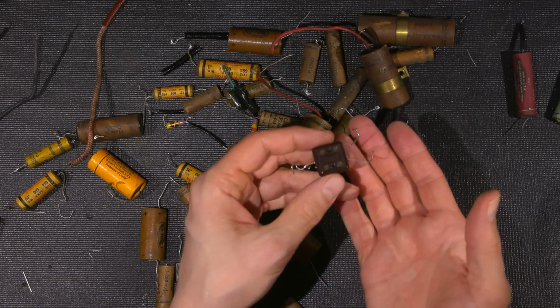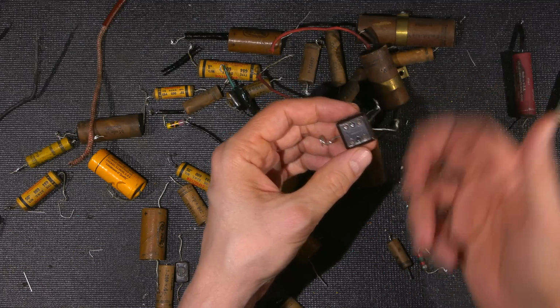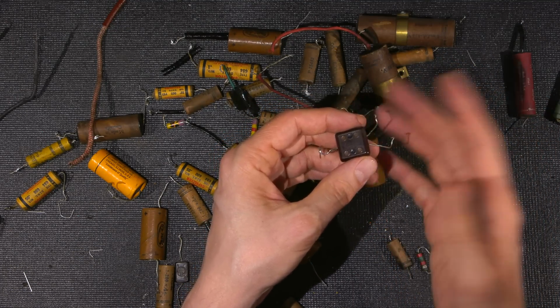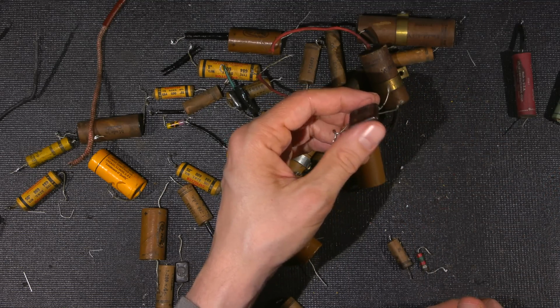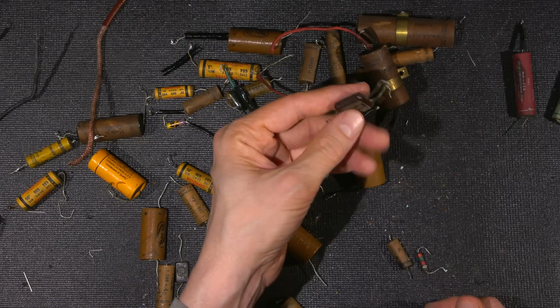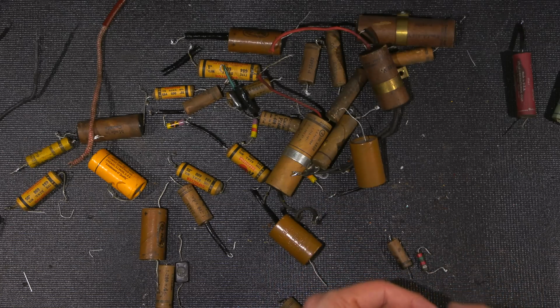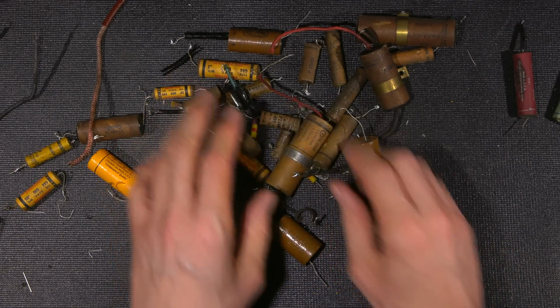Now, you'll test it on your normal tester, and it'll look fine. But if you do an extensive test with the capacitor tester that I've created, you can really see the problem. I created that capacitor tester because I was working on transmitting gear, and some very high voltage mica capacitors were not showing any problems on any test equipment, even modern stuff. So I had to design my own piece of test equipment to find the problems, and it sure enough did.